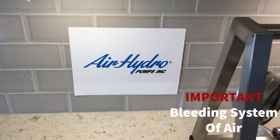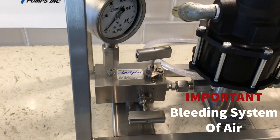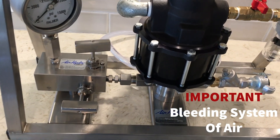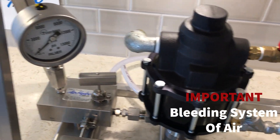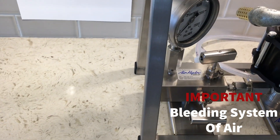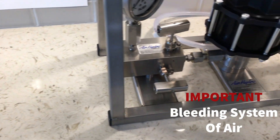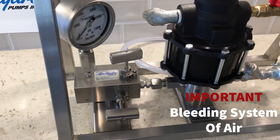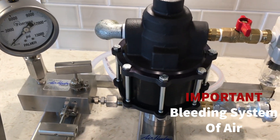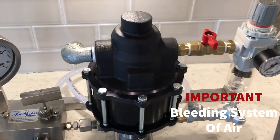The specimen connected to the APU via the hose should have some sort of port with a plug or a bleed valve to bleed the air out of the test specimen prior to pressurizing it using the APU. It's very important to evacuate all air out of the output hose and the item to be pressurized. Usually this is done using a bleed valve connected to the test specimen, or a test plug. The test plug or bleed valve should be open before starting the pump.